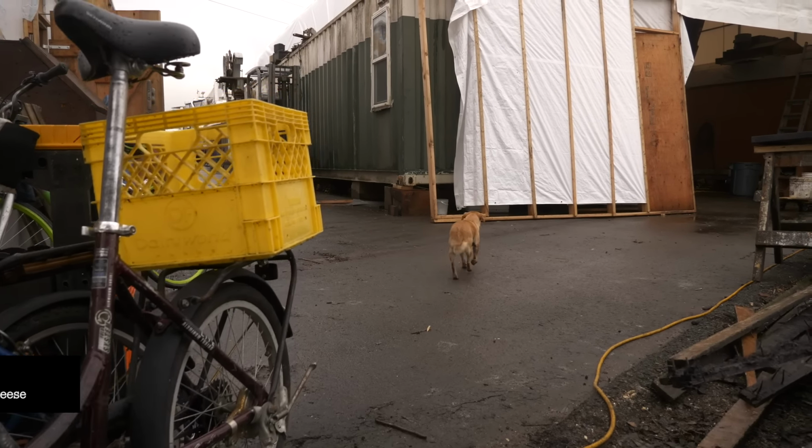Now we're removing the shear plank, or what remains of the shear plank. Our main objective being we want to see what the ends of our frame heads look like. And from first inspection here, it doesn't bode well for the rest of the frame. Probably continues down most of the way.